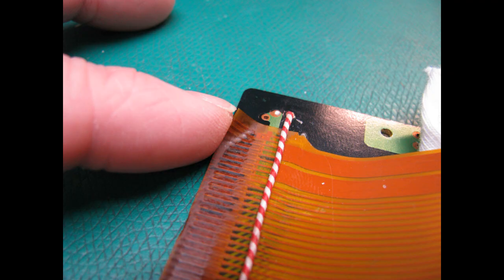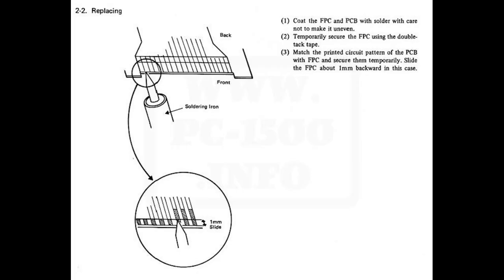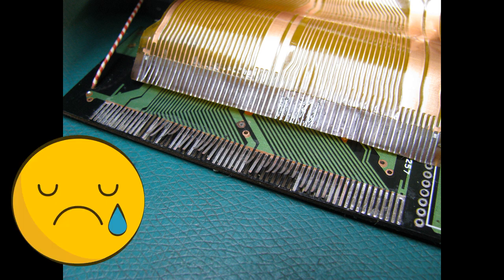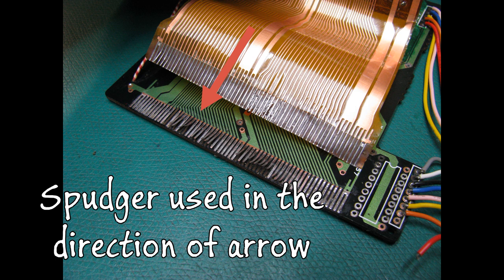Knowing that the frayed wire was no longer causing a problem, I began to focus on the flex PCB connection again. I noticed that if I pressed on the PCB just above the stepper driver chip, it would work. The flex PCB is connected to the rigid PCB with some conductive glue. I've heard that reheating this with the soldering iron might reactivate and seal the glue, but this didn't work — maybe due to the battery corrosion. In the TRS-80 PC2 manual, there was a page talking about detaching and reattaching the keyboard flex PCB. Having nothing to lose at this point, I gave it a go on the CE-150 board, and well, it was a disaster. I tried to peel it up from the side, which did not work out well. I switched to using a plastic spudger tool inserted from the inside, and this worked well, but much damage had already been done.